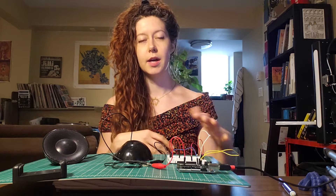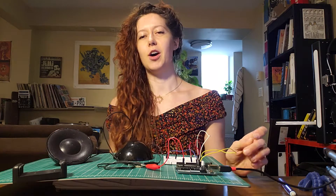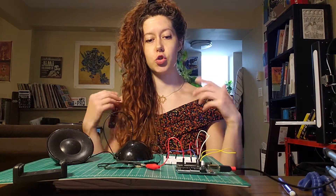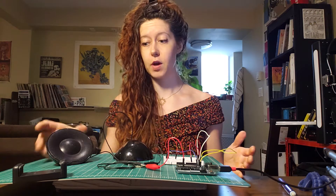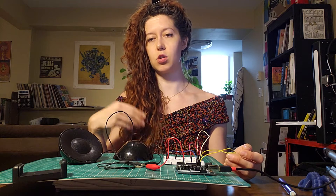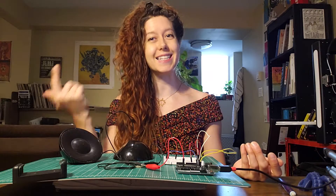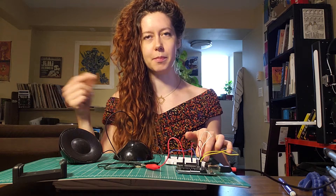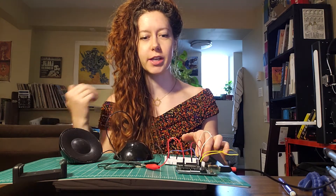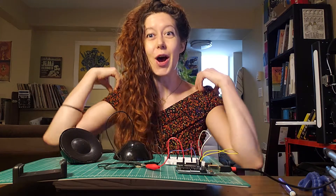Basically the code is super simple. All it's doing is using delay. I'm using an Arduino Uno and a little speaker, and I'm using the delay function to basically pulse an electrical signal on and off. If the signal is really really slow we can actually hear it as a series of clicks. But as it gets faster and faster, it becomes so fast that our ears don't hear it as a series of clicks — we hear it as a note.